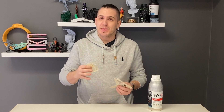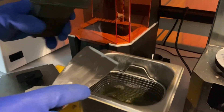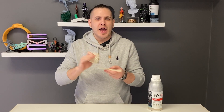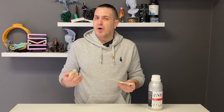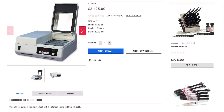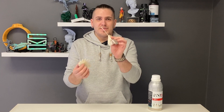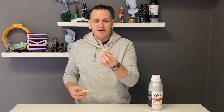Washing this material can be a little bit difficult. The resin doesn't dissolve away as easily as others. It does break down in the alcohol as it should, but not very easily. The finish on the surface of the parts is matte, as advertised, and actually kind of appears powdery, but it actually isn't — it's just a surface thing. It kind of reminds me of bone, actually. You can put the prints in water or glycerin, or use a higher-end cure unit with nitrogen flooding during the UV cure to make the finish a little bit nicer.